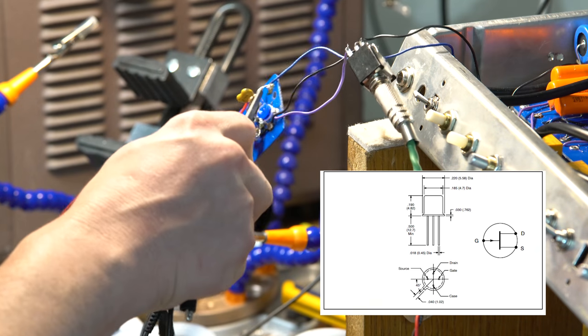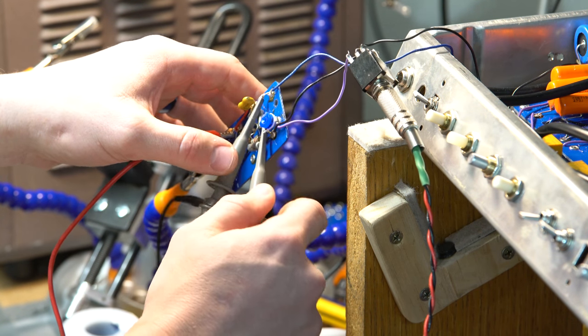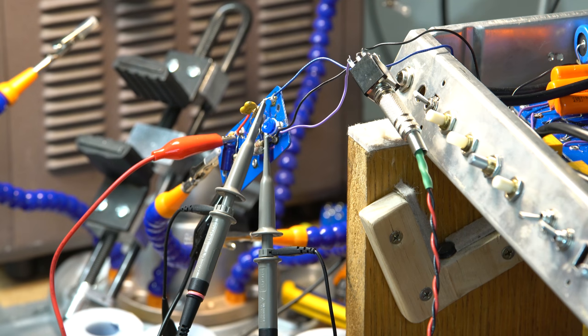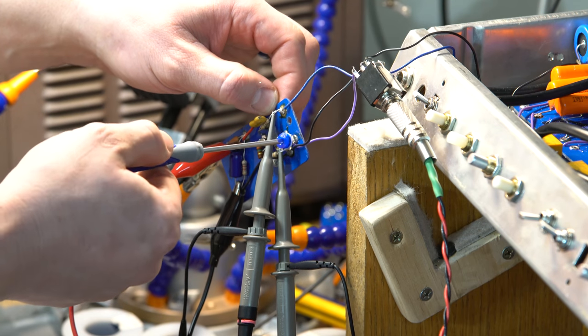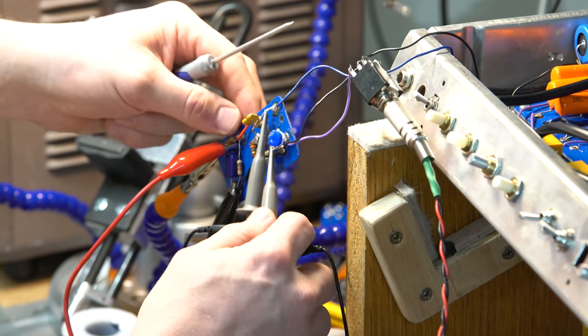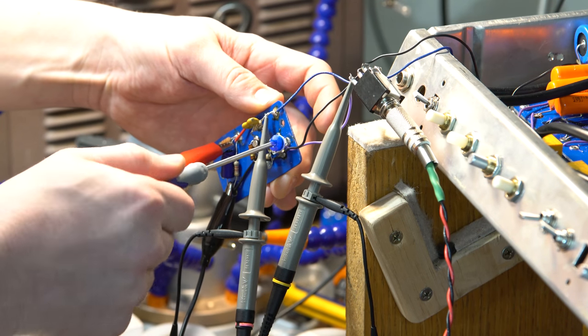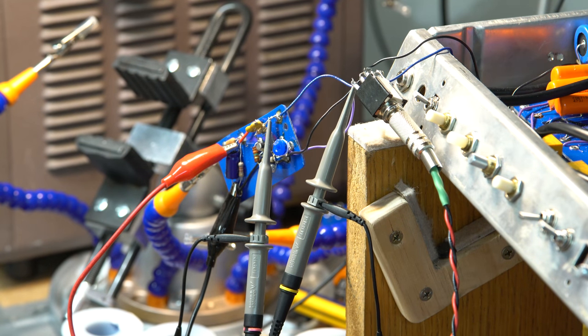I'm going to turn on the 8 volt supply. I had one clip connected to the input showing signal, and now I'm clipping to the output — I'm getting output! If I clip to the output I now have a very strong signal coming out. I want to dial that down a little though because it's coming in really hot and clipping heavily. It looks like I may have melted the top of this component slightly. I'll dial down the output — but it doesn't remove that squared-off clipped waveform top, so maybe that's part of what needs to be biased correctly.